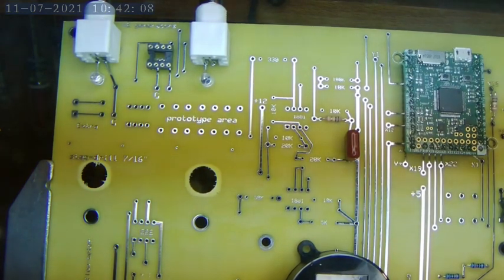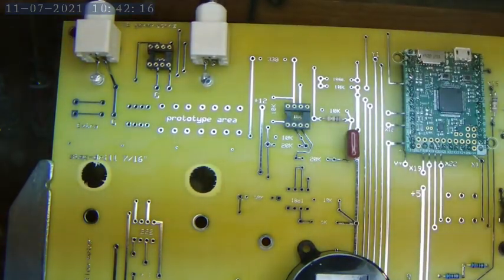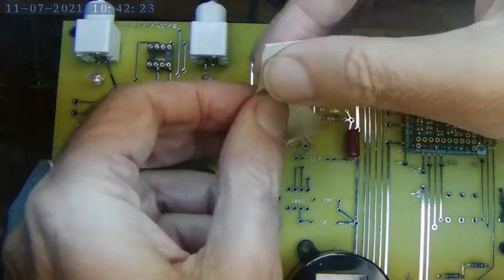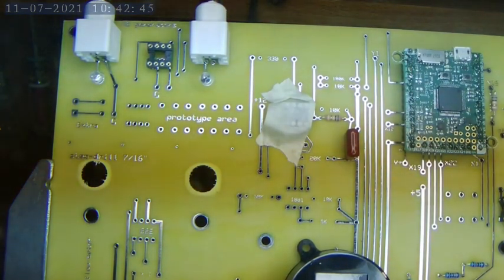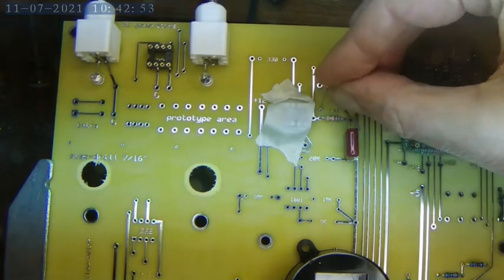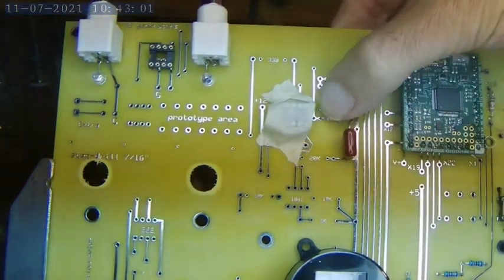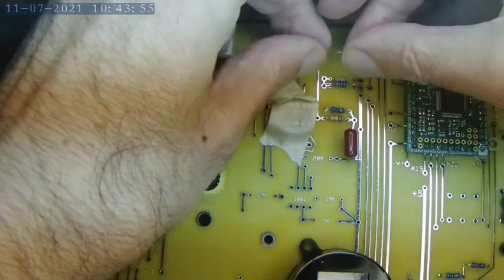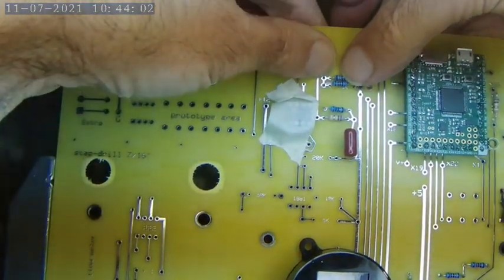That's then going to go to this 1881 model amplifier. There are actually two amplifiers on the chip, but the first one will take this filtered voltage, and we actually amplify that a little bit, well, tenfold, with a couple of 10K resistors on the input, and then the ratio of the 100K to 10K will give us a gain of 10.